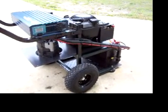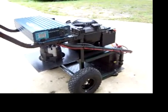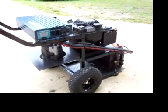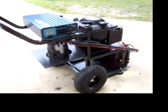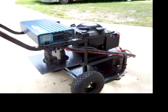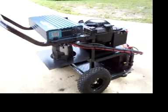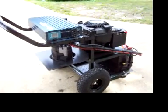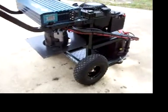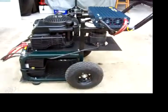Some people are wondering why you would build such a device. At campsites with noise abatement rules, you've got to shut your generators down at midnight. The good thing with this is the combustion engine charges the battery, and when you shut it down the alternator no longer charges, but the stored energy will run the inverter — you can still run all your appliances and be quiet. It's fairly simple.